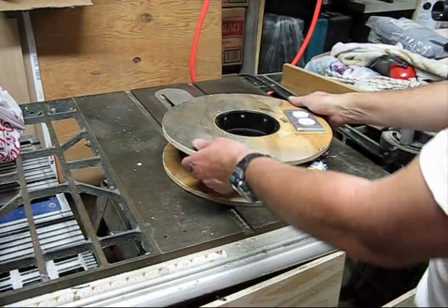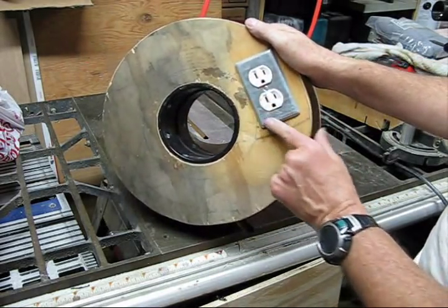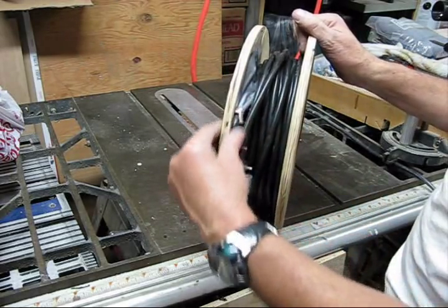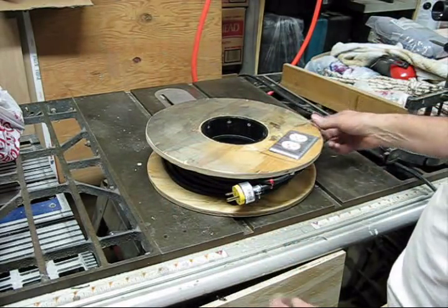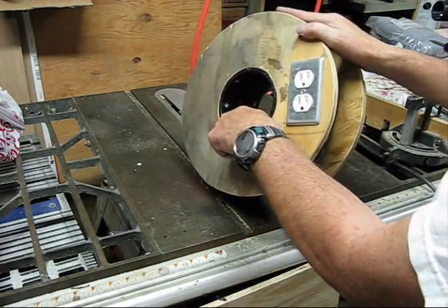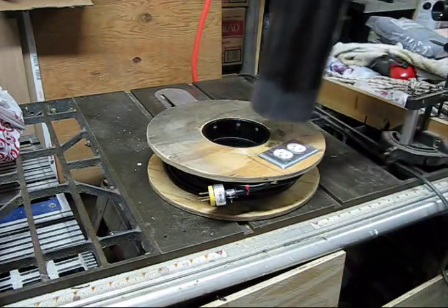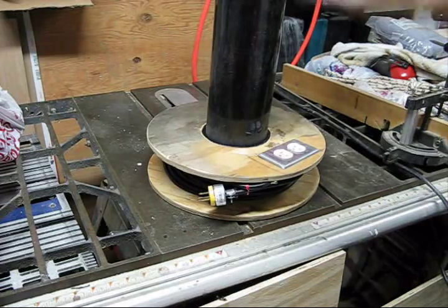Here's the bottom stand and spool all finished. I mounted a receptacle here and wound about 70 feet of extension cord, covered it with duct tape in the back so it won't short. I wired it up so I can hook the light into this, and also a radio or a battery charger. I attached the coupling with countersunk sheet metal screws, so that when the stand is put on it'll mount stably like this. Then your lamp goes on the top of this.